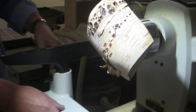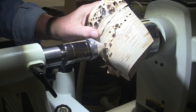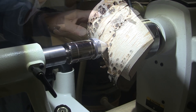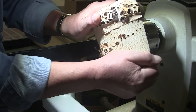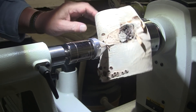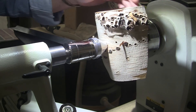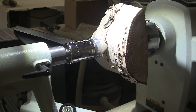I like to bring up my tailstock and drive this into the chuck so that I know that it's well-seated, then loosen the chuck up, drive it in there, and tighten the jaws. I'm pulling pretty hard here, wiggling — I think it's going to hold. This is such a small piece I could have tailstock support for a short time. I guess I will — why tempt fate, right? Let me get my mask and face shield on and sharpen up a bowl gouge and we'll get to turning.